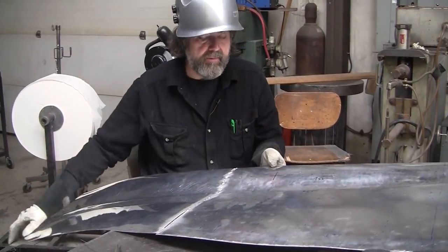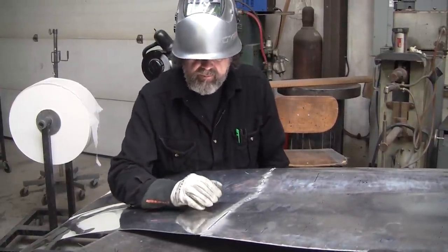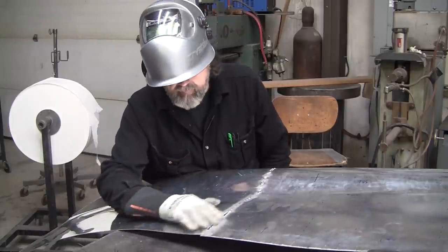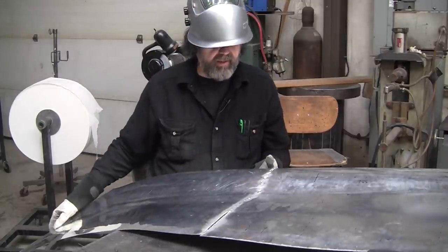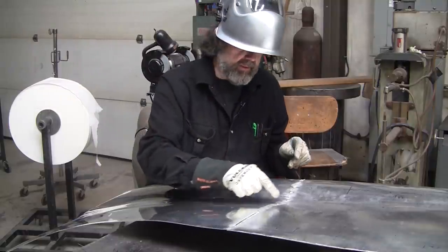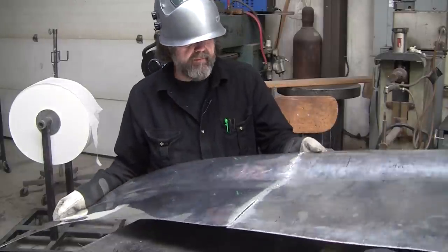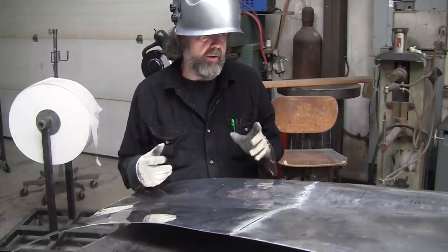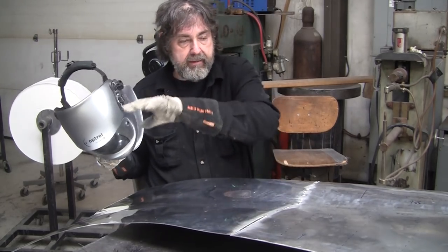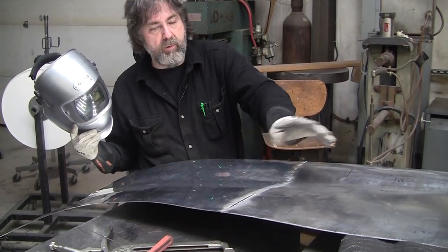I find that if you do fusion welds, they look really sweet, but you'll end up with some divots here and there, and I like no divots at all, so I'll have to do a little grinding, but grinding doesn't scare me. We'll planish that out. So the next video, we'll finish doing the welding and do all the grinding and planishing and everything, and this will be an assembly. And hopefully I can get some time together and make the other side of this. So then the next videos will be the assembly videos, a lot more welding.